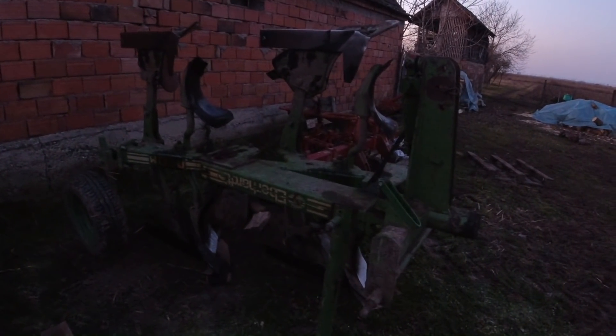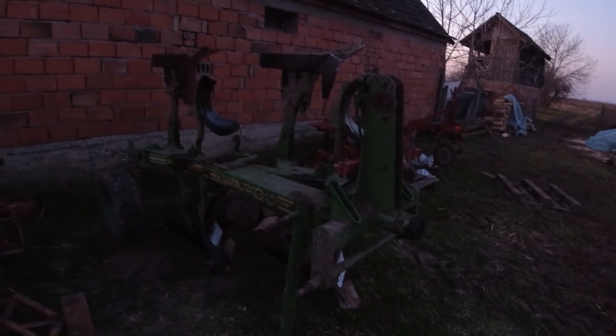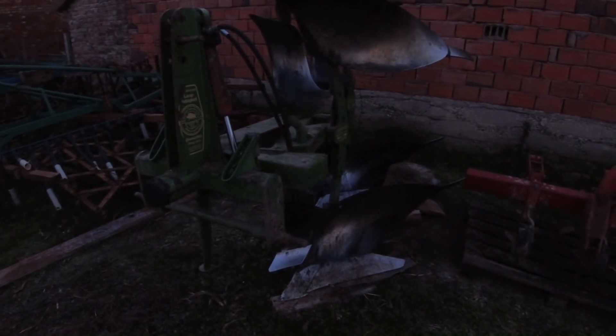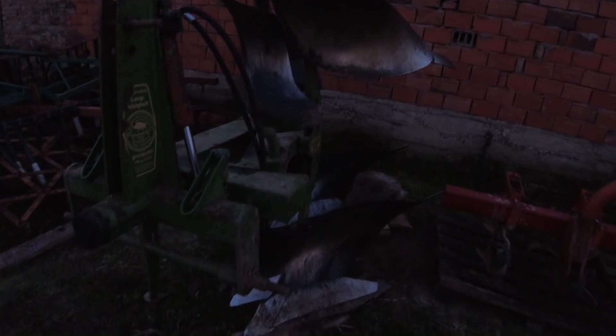The plow is truly of massive construction and is quite heavy for my tractor, but as for pulling the plow, that has absolutely nothing to do with it — whether it has 100 kg or 500 kg, 12 inches is 12 inches. In the conditions I was working in, I would say it pulled really easily. The depth wasn't excessive — I plowed to about 25 cm — but given the conditions, you could see for yourselves how it looks after plowing — it pulled quite lightly for such conditions. Compared to the old IMT-756 I had before in these conditions, I think nothing would have come of that job.